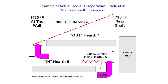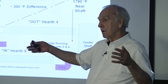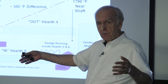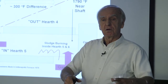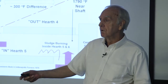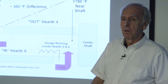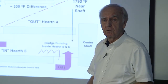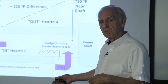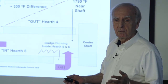As you've probably seen, you run a performance test — if you're caught at a higher feed rate on the outside of the hearth, you record a higher wall temperature. Then the next day the feed rate is lower, sludge is burning on the inside near the shaft, the thermocouple says you're only at 1,200 or 1,500 out here, and you've artificially had to fire burners to maintain the burn zone temperature. This is not a good rule, and hopefully down the road we can get EPA to reconsider it, because it's not even environmentally friendly as a consequence.